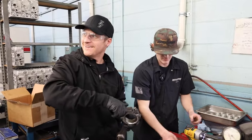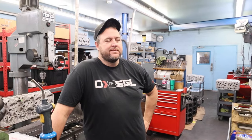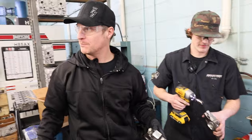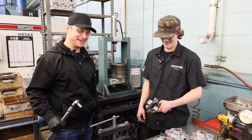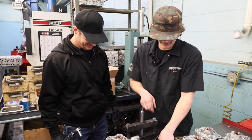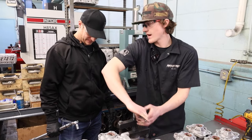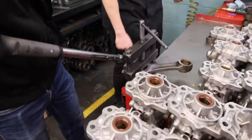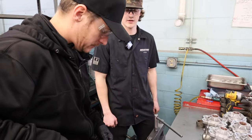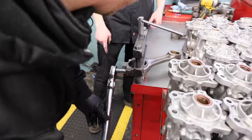It's the longest engine build I've ever seen — it takes a while when we all live 200 miles away from each other and can only make it happen once a month. We're going to use this clamp to hold the rod for us, then they get torqued to 90 foot-pounds. What I like to do is a pull, then go 90, 90 — a pull, then 90.